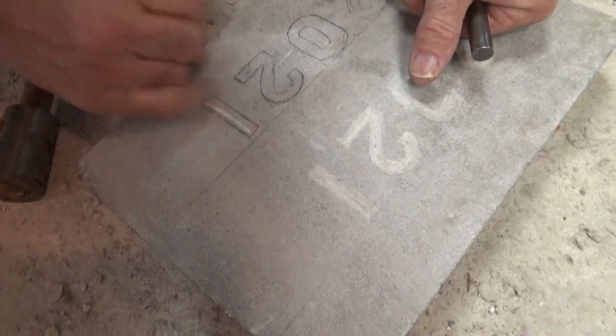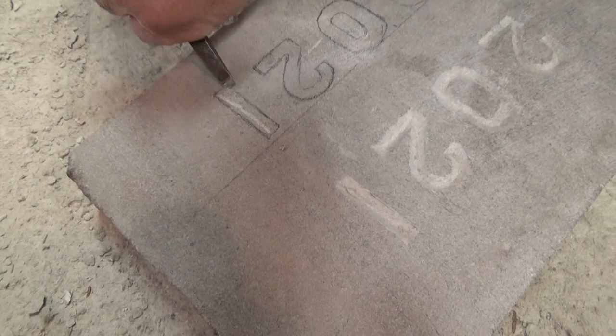and the idea is to make a V. And so this line is right in the center of the letter. So I don't want to get my chisel up in here making a gouge. It's got to be right in the center. But this is like chopping a piece of wood. If you've ever seen a lumberjack or somebody chopping a tree with an axe, you don't get wide at first. You start narrow and then you keep going out until you get what you want. So now we're going to go the opposite way.